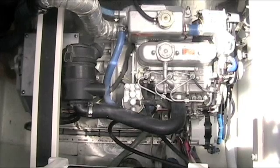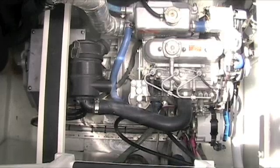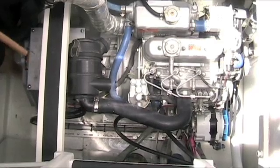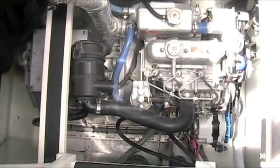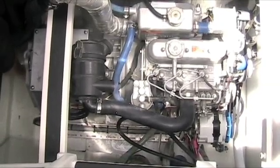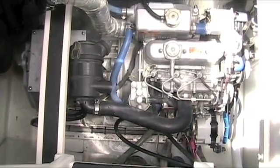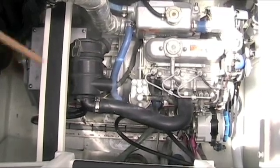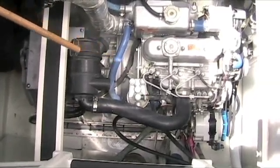For reliability, we built in a 20 percent safety margin. On Harmony, the drive motors are 10 horsepower, and we made sure that this generator could provide at least 12 horsepower. We also know from experience that passage making is a small portion of a vessel's life, and sailboats use motors even less. So the primary use of this whole gen set and generator is charging house batteries.